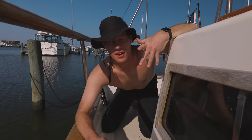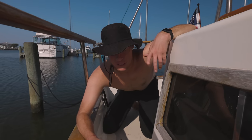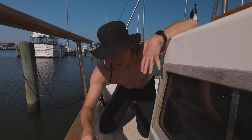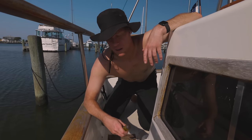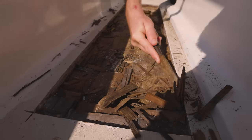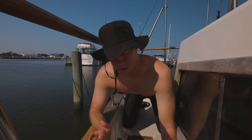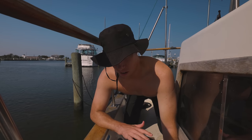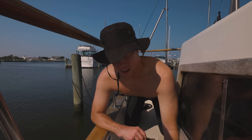The next day, we're out here ripping the wood off and putting in the labor. We ordered all the tools we think we're going to need for the next phase, but we're still having some problems finding the coring material — the half-inch marine plywood. So I'm spending my time etching away all of this dry rot and prepping the area because we're going to be doing a fiberglass patchwork. We ordered a multi-tool and hopefully that'll help us cut into the decks further, but I still need to clean off the bottom and top layers.